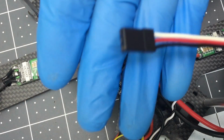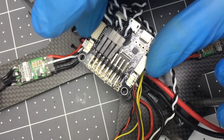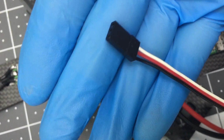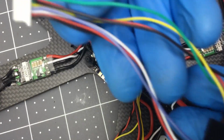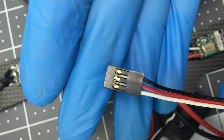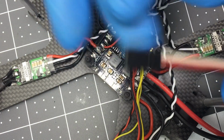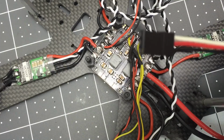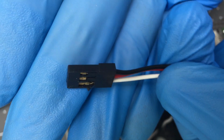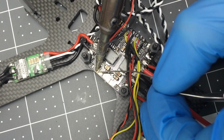I mean, it doesn't matter exactly which order, but I just need to connect a power line from the 5 volts and use that to power the flight controller, and the flight controller will also power your receiver. So you just need some sort of a little servo plug like this, or maybe just steal one from one of these plugs that come with the flight controller. This is from a servo extension wire, or you could get it from an old servo or an old speed controller, or pretty much anything that you don't mind chopping it off of. So I'm going to take out the white pin because I don't need that. Yeah, you just pry that back. So if you just lift that tab there, this should be able to just slide right out. And I'll just use this plug now.